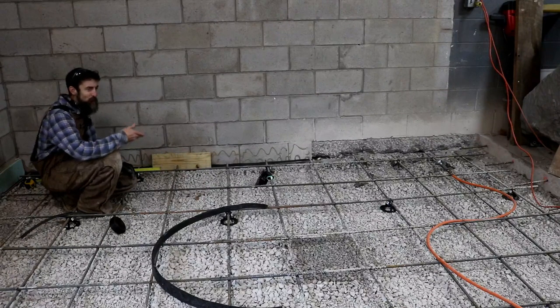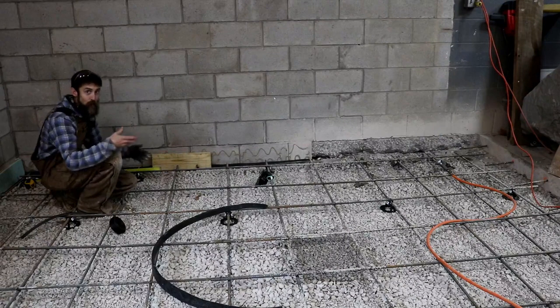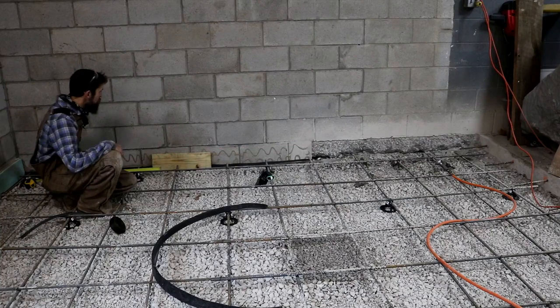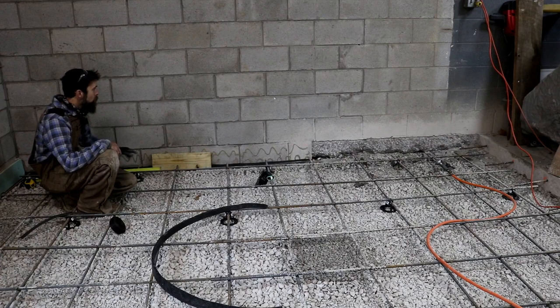But this is a rebuild and not new construction, so you just have to settle on some imperfections and deal with them. I'm sure the guys who've rebuilt old homes can attest, you just try to end up with the product that you're happy with and settle with it not being exactly what you want. But that's what I'm going to do, run my treated lumber all the way up to the top of the pad instead of to the top of the laser line on this back wall.